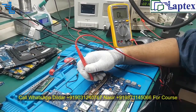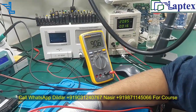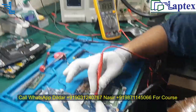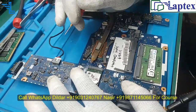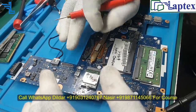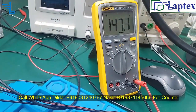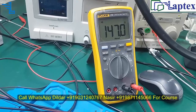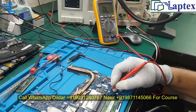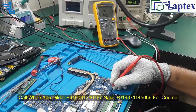Now we are checking the core coil impedance value — it is giving us 90 ohms, so it is also healthy. One is RAM. These three areas are responsible: if you have a low value, the root cause goes to the CPU area. That is why we should make sure we have healthy values on these given coils. Here we have 147 ohms — that is also good. Now 3.3V and 5V are over the limit, indicating a good healthy value on this point.